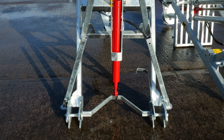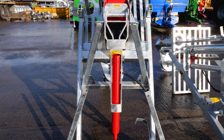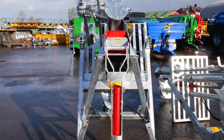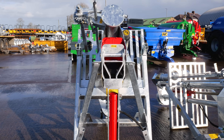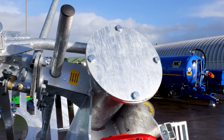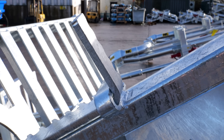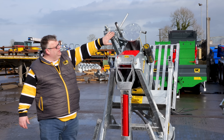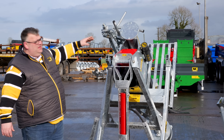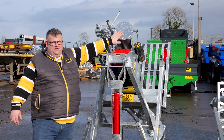These are a very popular pump. It's your usual 540 speed on your gearbox — it's a Rogelberg gearbox. You have your blanked-off port here for where your top fill valve will go for pumping slurry from tank to tank or for filling with a top fill pipe. You have your deflector arm control, your rotation for your spout, and then your changeover lever for mix to fill — changing the pump from mixing through your spout to top fill if you have a valve on the top.